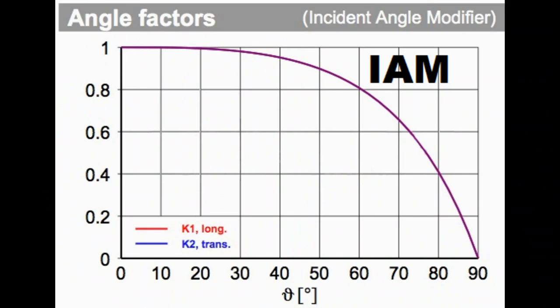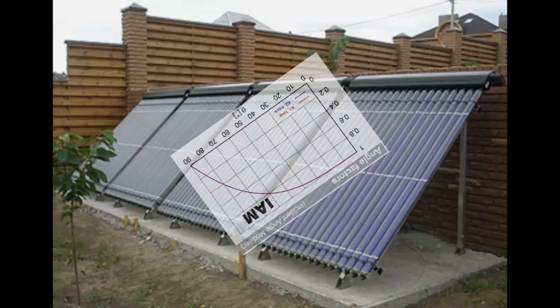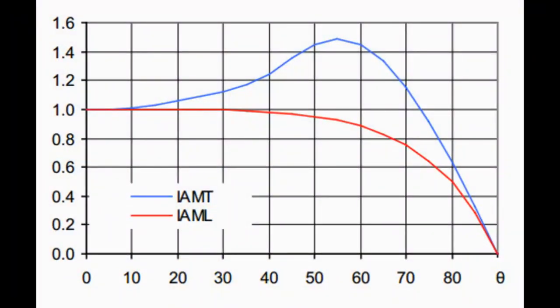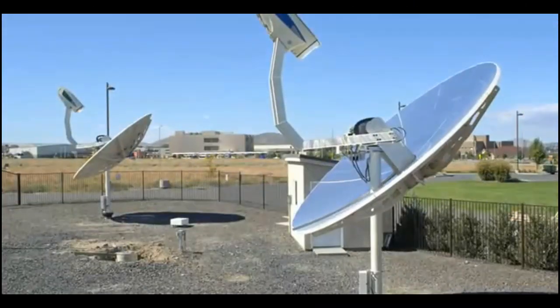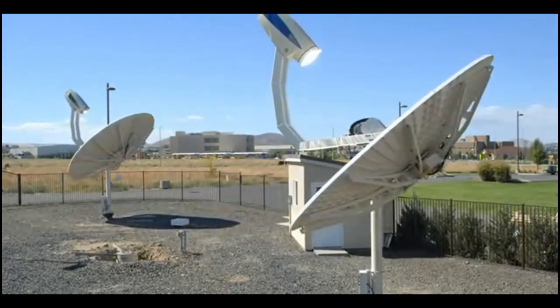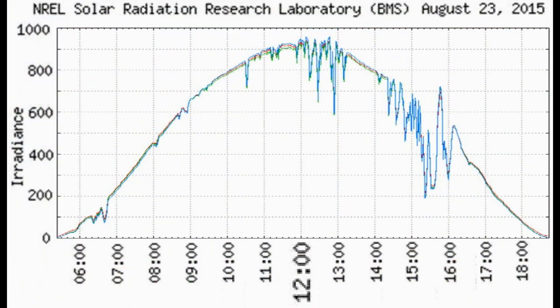We can use this graph which corresponds to a traditional flat plate solar collector, but other types of solar collectors usually have similar graphs, except for evacuated tubes which approximately correspond to such a different graph. However, our coefficient should not be taken into account in cases of such solar heaters which constantly follow the sun, and these cases require the use of different graphs which will be described in a few minutes.